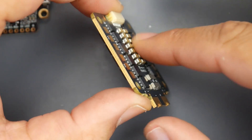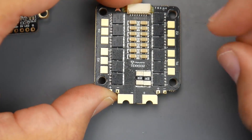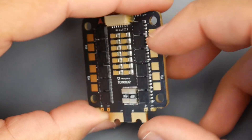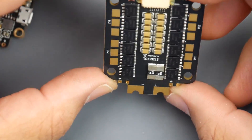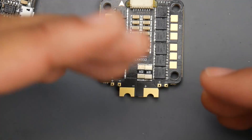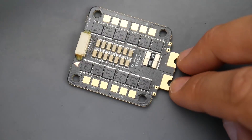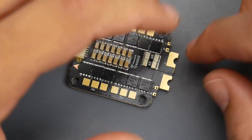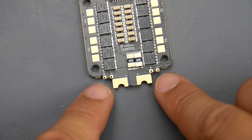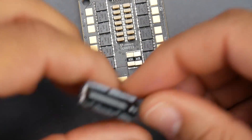Let's take a closer look at this ESC. The filtration isn't massive but it's still pretty good - better than a lot of others I've seen. The solder pads are recessed inward which gives a much cleaner look and is easier when soldering wires. Looking at the PCB they've even done edge plating to improve overall current flow, which is a really expensive process for any manufacturer. Something I really like are these two breakout pads here for raw battery voltage, so you can power your VTX directly from here instead of having to solder wire-over-wire on the main battery pads.